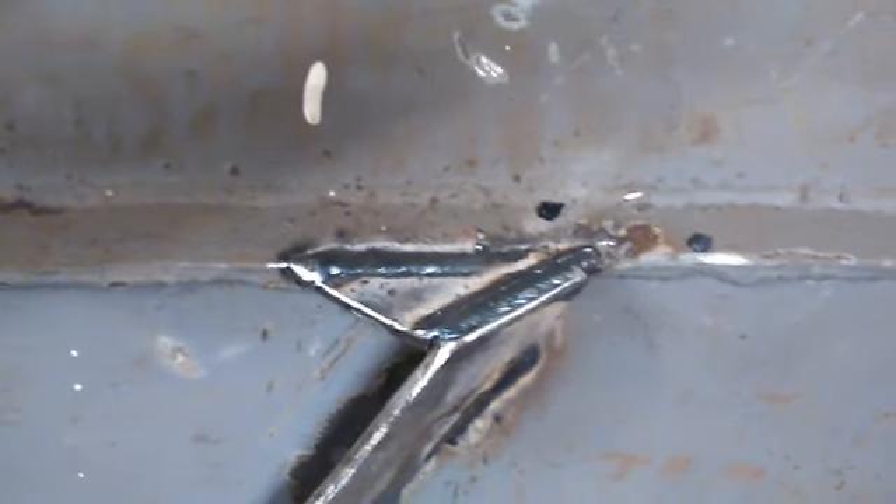Obviously I cleaned it all, ground it all back. It's done the job, however in hindsight I wish I'd just cut it out and put a new piece of plate in - there was too much pitting on that bit. Also on the other side was the same - there's a bit of pitting there but it's not deep pitting. I did up there the same, and I'm wishing I'd cut the piece of steel out and just put a new bit. It would have been quicker than filling it up and then grinding it all off. So that's the other frame in there and all the stringer, and I've also joined them at the top with a little gusset to take it to the side chines. That's about a better shot there - so that's that bit sorted.